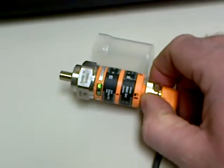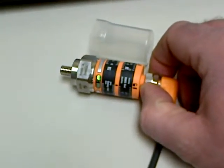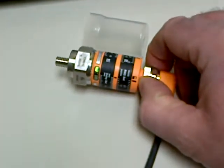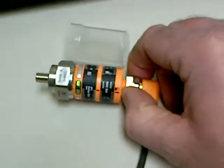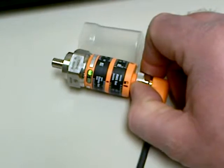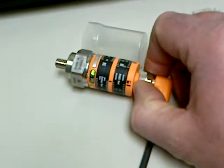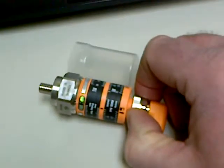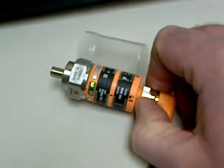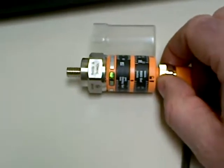The switch itself is rated for 18 to 36 volts DC input power and IP67. So if you were going to use this in a mobile application, you would probably have to supply a 24-volt supply, or if the machine is already 24 volts that would be fine. But a 12-volt supply voltage would make this a little bit difficult — you would probably have to get a step-up transformer, which are available.